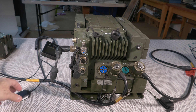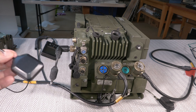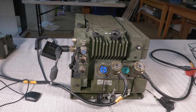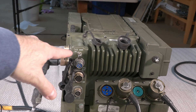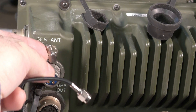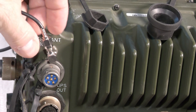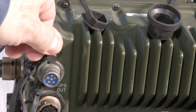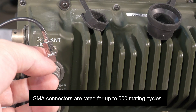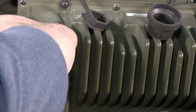The first thing we have to do is connect up the antenna. This is the antenna — it's a little magnetic unit, and I think it takes about 5 volts. This happens to be a Trimble. Here's the other end of it; it's an SMA. SMA connectors are not all that robust, which is a little surprising for a military setting. Here's the SMA connector on the back of the VAA, and what I've done is use a little right-angle SMA male-to-female adapter. The reason I like to do that is because as I install and uninstall this, I'll be making a lot of mating and unmating cycles. Since SMA connectors are only rated for a limited number of mating cycles, I'd rather potentially wear out the connector on this elbow than on the radio itself.